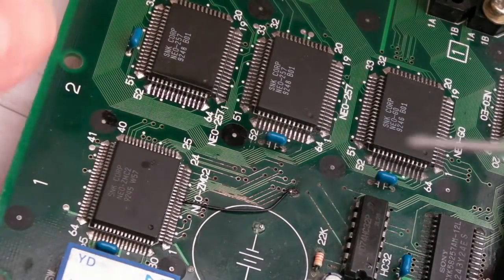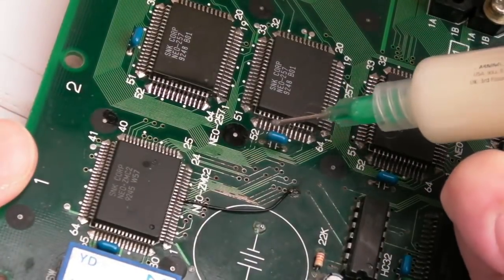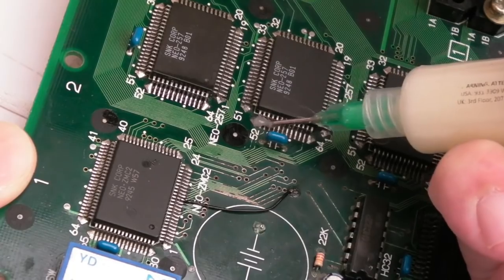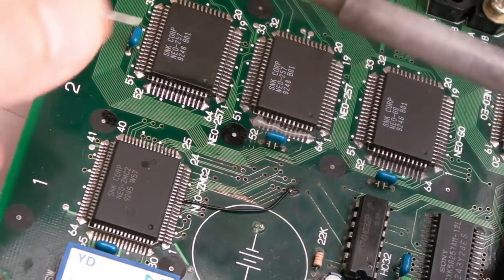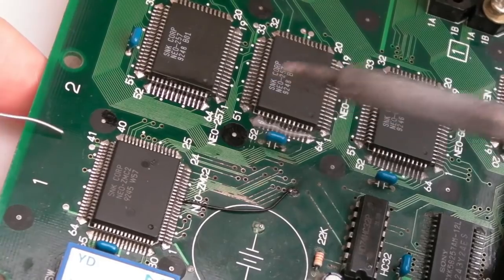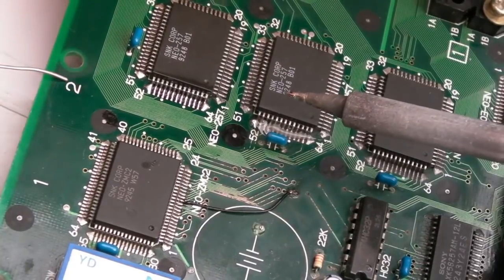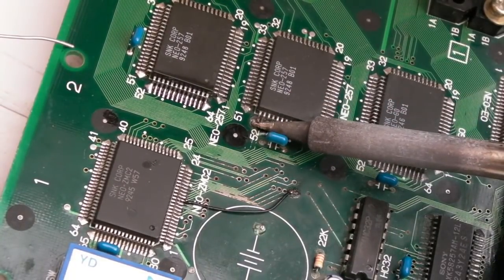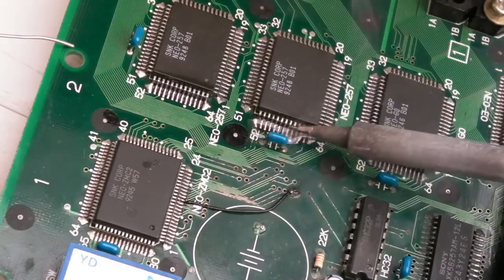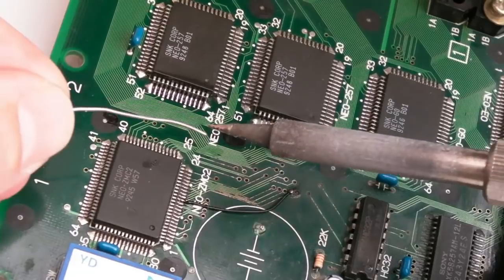So obviously I've used the fiberglass brush, I've used vinegar, a number of passes there. Fiberglass has been on there three or four times and it's looking a lot better, but it's pretty dull, so we'll just get some flux along here. And then what I'll do is I'll attempt to add some solder to start with. So I'm not bothered about this being particularly clean at this stage. I could do with the fan on really. So yeah, as you can see, some are flowing really well, others may not, but then we'll remove this with some braid. Just get a bit more.